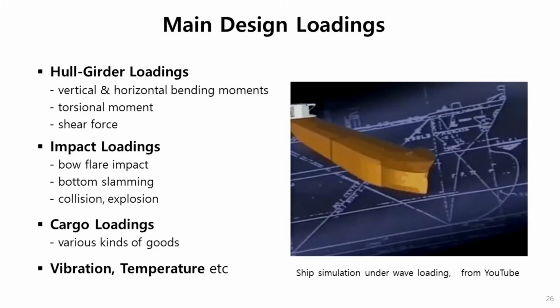Let's see. A simple understanding of the strength and forces acting on a ship's structure is also important. An optimal ship structure has the minimum amount of steel to provide the strength and stiffness necessary to withstand the full range of internal and external forces exerted on it from sources such as the light ship weight, the weight of cargo, ballast, fuel, etc. And of course the harsh sea, the marine environment, the movement of the ship, and vibration.